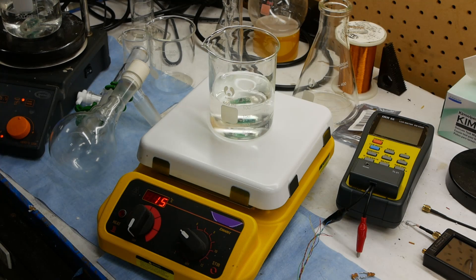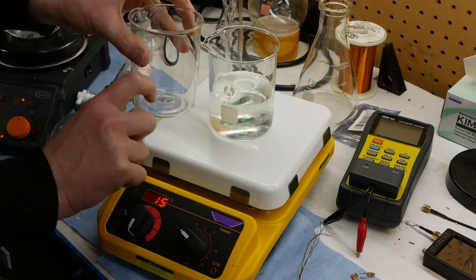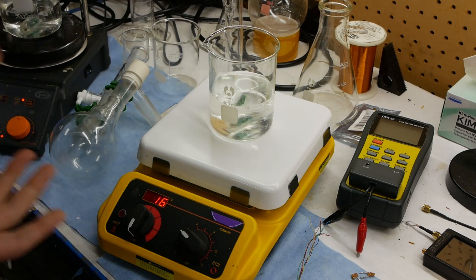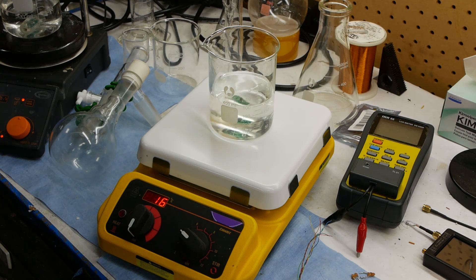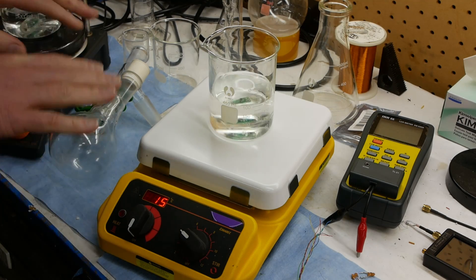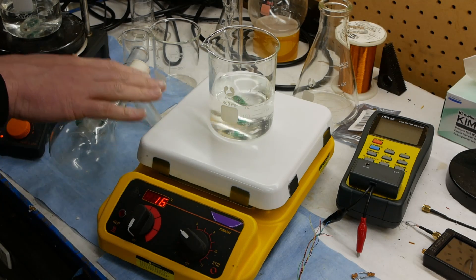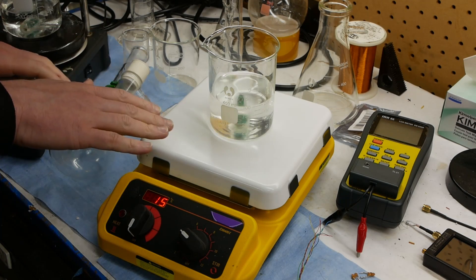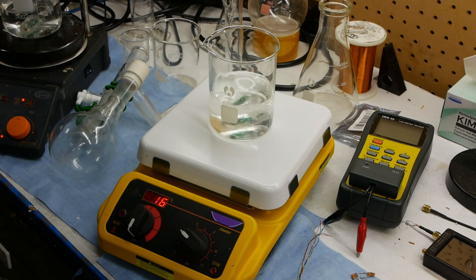Since each tag has a serial number, you could also do some types of auditing or tracking in a lab. For example, the beaker could have a captive stir bar in the bottom — like a glass cage that keeps the stir bar as part of the beaker. That way the beaker would have a serial number and could record things like the number of thermal cycles it's been through, the maximum temperature it's ever been exposed to, and potentially how long it's been used in the lab if it writes the date and time to the tag. There can be non-volatile memory in the stir bar itself, which opens up a whole bunch of other possibilities. Once you've already done the work of putting the board into the stir bar, you get all this other stuff — serial number, tracking, non-volatile storage — for essentially no additional hardware cost.